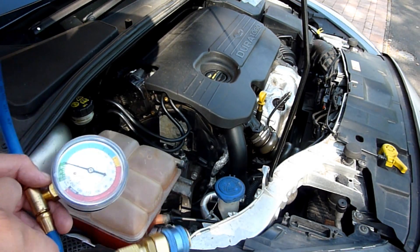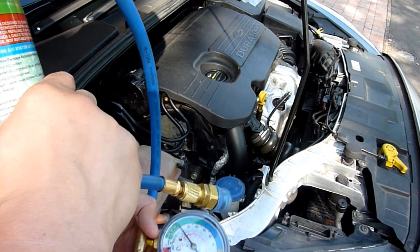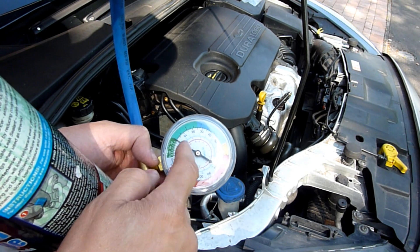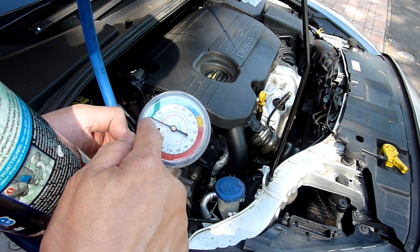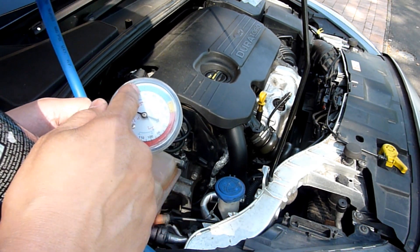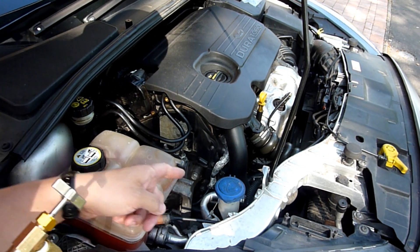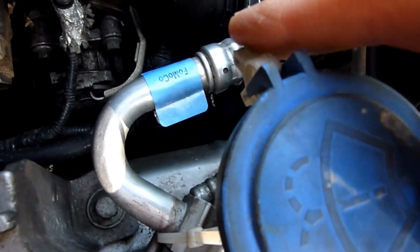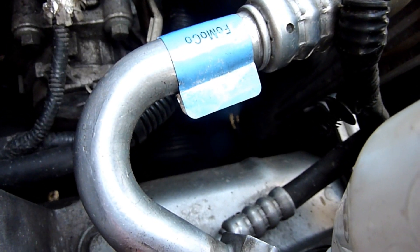You can kind of weigh it out — if it was completely empty, weigh in the exact amount. But if you're just topping up, they buy these kits for top-ups. You'll find that as soon as I connect this gauge onto the low port, it'll kind of zoom up a little bit. How do you know you're just topping up? When you look down at your compressor — my compressor's down there — hopefully you should be able to see it, it's just spinning.